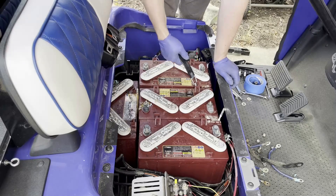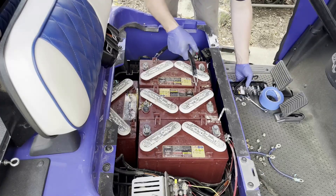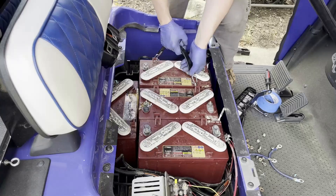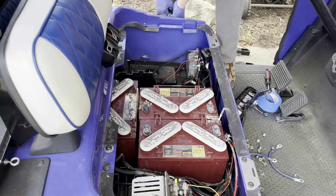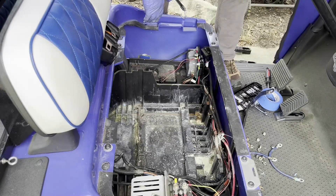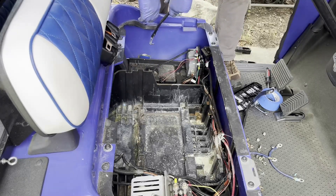I've got a nice handle I can use to pull out the batteries — and again, they're very heavy, so make sure you're very stable and use both hands to pull them out; you don't want to drop them. Do it one by one. As you can see, we just removed the batteries — they were pretty heavy but not too bad. This is actually a two-man job, so I highly recommend two people for safety. There is acid all over the place that came out of the batteries, so we're going to mix baking soda with water, roughly 50/50, and spray and wash it.